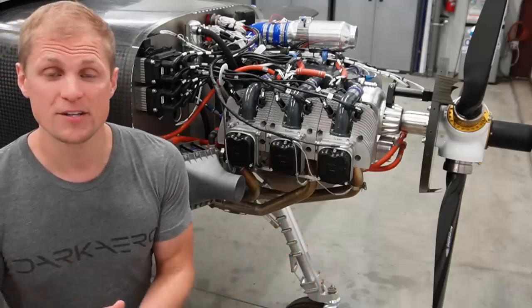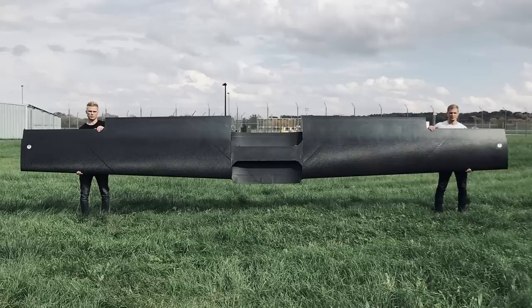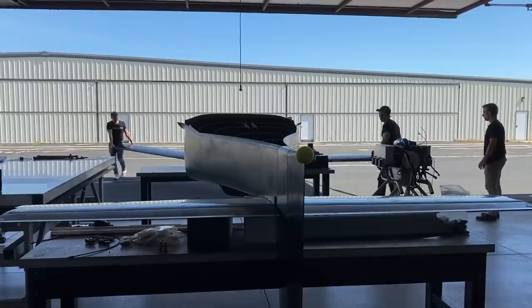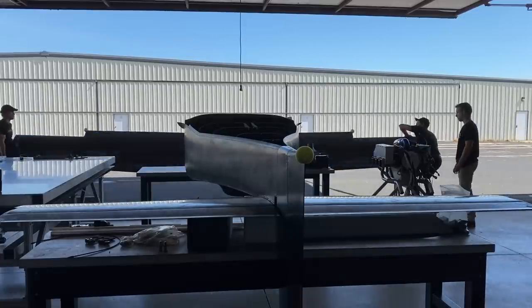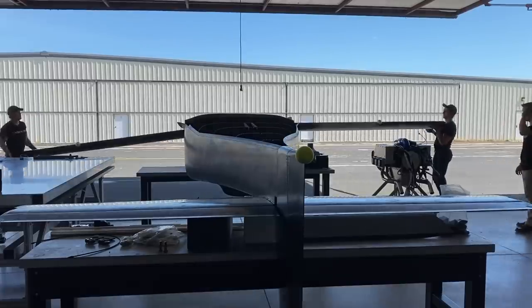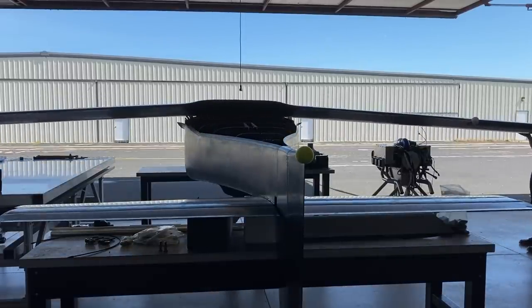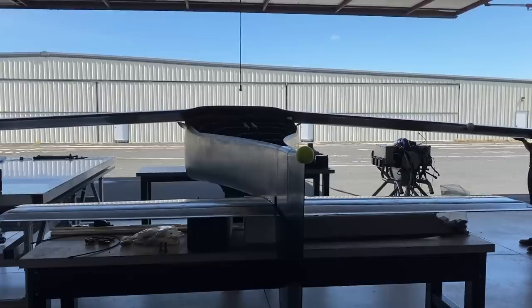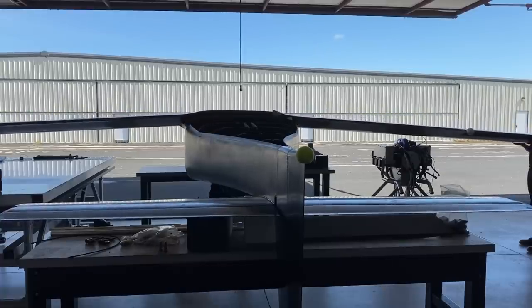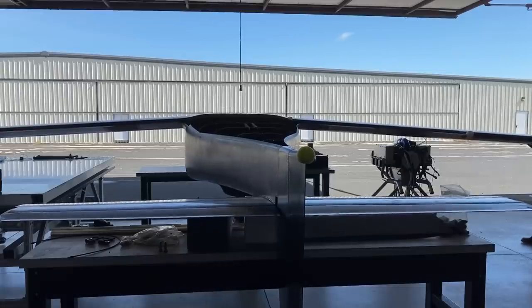There were a couple other areas in the airplane where we applied this philosophy. The wing on our airplane is built in one large piece rather than being broken up into sections as you normally see in light aircraft. It doesn't really make sense to build the most heavily loaded structure in the airplane in multiple sections and then join those sections together with pins or bolted joints. Joints require additional hardware and they act as stress concentrations that need additional reinforcement structure. It's just lighter and more structurally efficient to build the wing in one large piece.